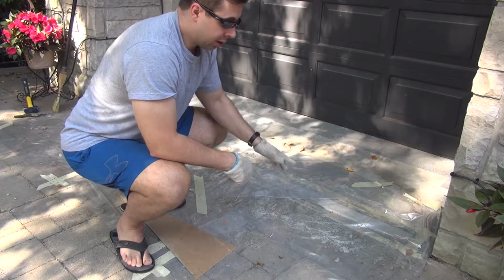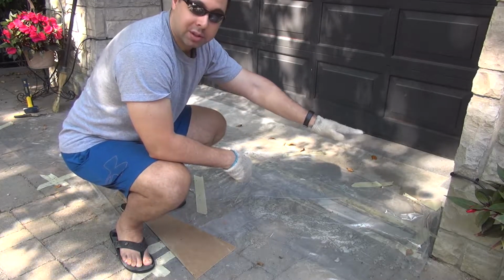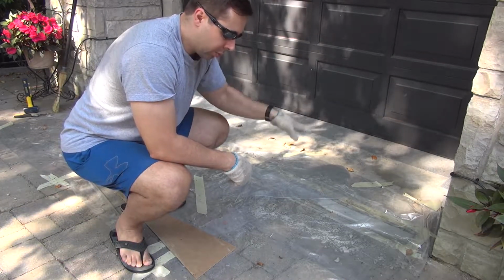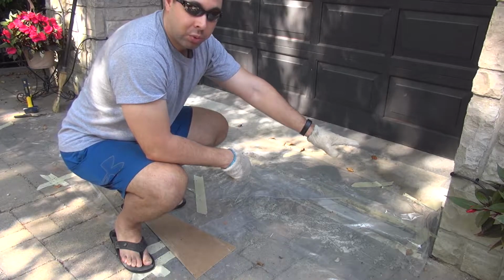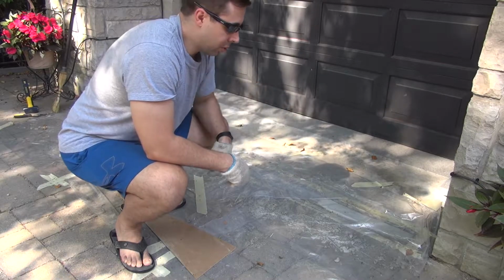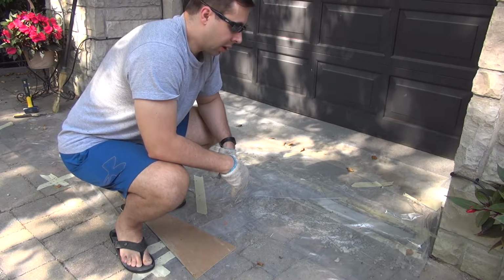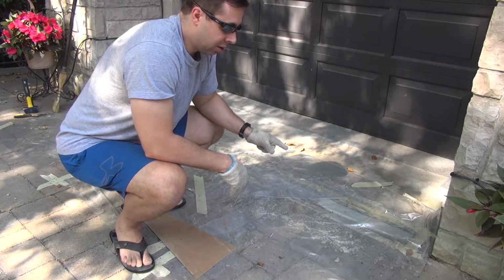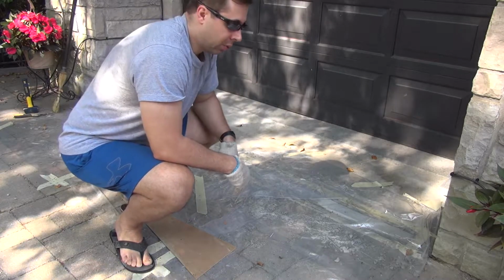Another thing is that if it's too hot outside, then the outer layer of moist concrete, the water is just going to evaporate instead of bind into proper strong concrete. And that means there's not going to be enough water in the top layer to form crystals of concrete to the extent that it's supposed to do. And again, that results in weaker concrete that's going to flake, that's going to peel off, things like that. Not great. That's why in the hotter temperatures, you want to retain this moisture for as long as the concrete sets, at least, if not cures.